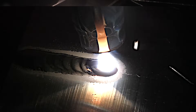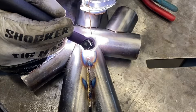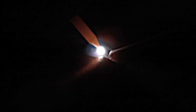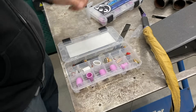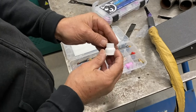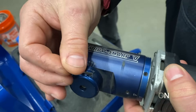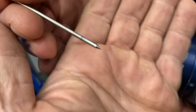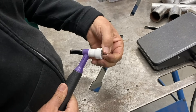I've done quite a bit of testing on AC on this PrimeWeld machine. Now it's time to switch gears and do a little testing on DC — we're going to do some pedal pumping on 4130 chromoly. We'll throw on a Furick ceramic 12 cup, bump the argon flow up to about 30 CFH, and sharpen the 3/32 two-percent lanthanated tungsten to around a 30-degree taper.